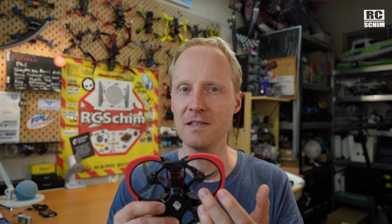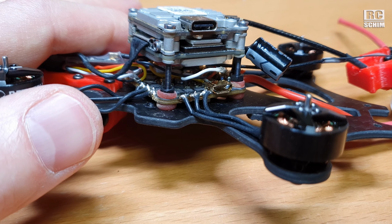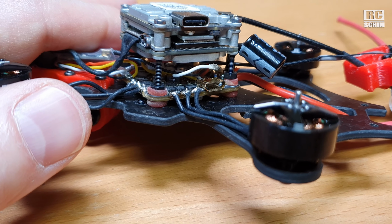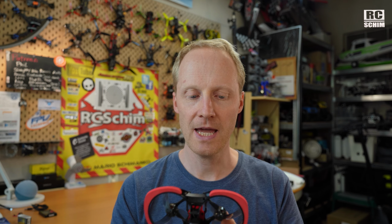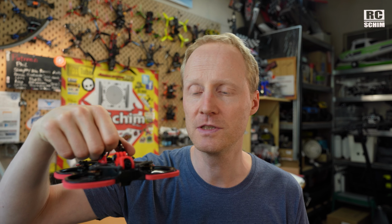Because what happened was I didn't see that this motor had burnt, and the dead motor also killed my second board. In this last attempt I used a different FC all-in-one board, the one from the GepRC Baby Croc. Installed this board, and totally different motors this time. So there is a problem either with the quality control of the motors, or something is terribly wrong with this copter that burns motors too easily.